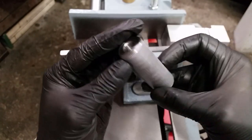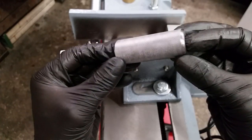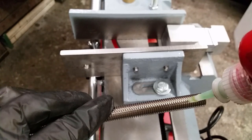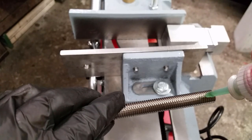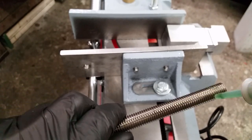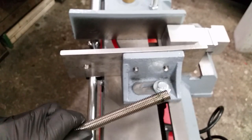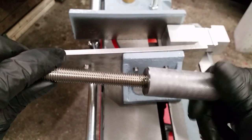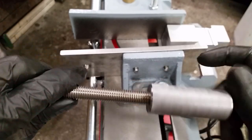Time to attach the handle to the rod. For joining those pieces together I'm using the Chinese variation of Loctite. This is not a threadlocker, although I'm using it as such. Normally this is used to fix gears on a shaft. Without heating, this handle will never become loose.